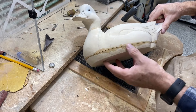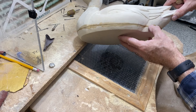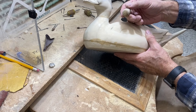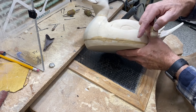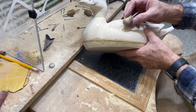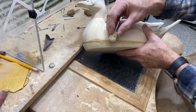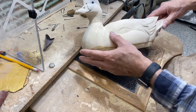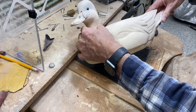First thing I want to do is peel off any excess epoxy and also fix any mismatch in the upper and lower halves — there always seems to be a bit. I'm going to use an old saber-tooth burr, a three-quarter inch burr that I use for this purpose, because even cured two-part epoxy tends to junk up your good burrs. There's a build-up right there, but this burr still has enough texture to clean this off — perfect for that purpose.